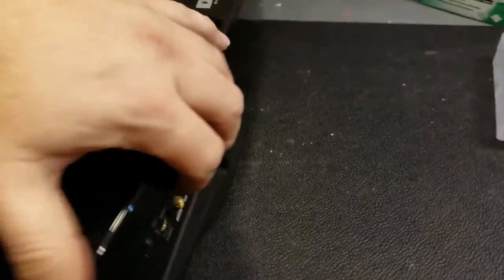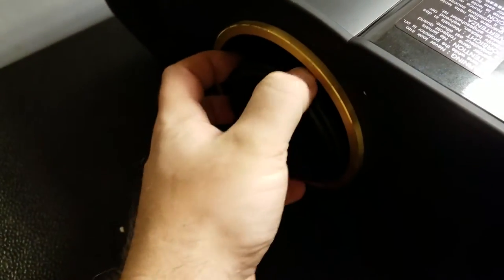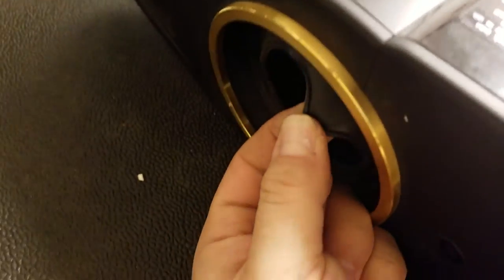There's two under here. Getting this top off is a little weird — I've had to figure out the proper way to do it. There's a stretchy rubber gasket that goes around the lens. What I usually do is get everything kind of loose and then finagle it free. Get the top up, move it forward a little bit, move that front piece forward so it separates underneath, and then that rubber pops off all by itself. So now the top's off.